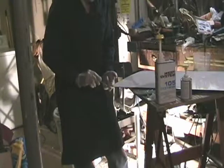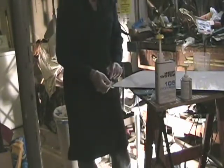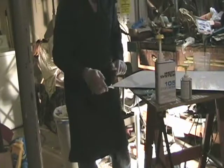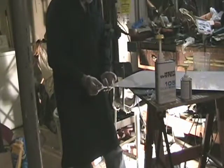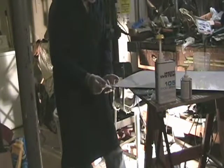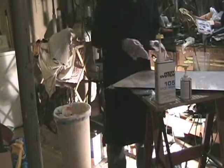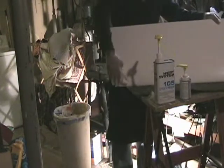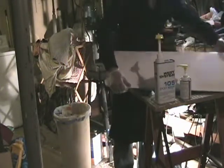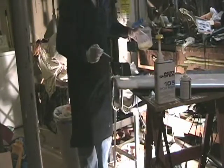I'm just using a disposable acid brush to work the resin up between the layers. Just add a little bit as needed, but don't use too much resin. I'm going to flip it over now and do the other side. It's always best to do everything in one layup if you can — less bonding between dried layers.